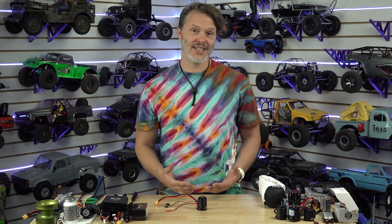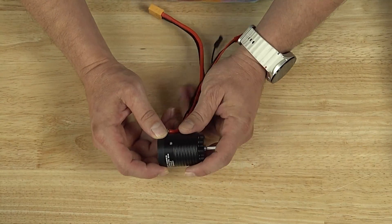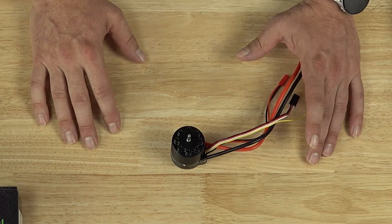For the 3000s, it's what I tested exclusively and I never had any heat problems. However, some of y'all have had heat problems. What we're doing is changing both our MOSFETs in there, reducing our MOSFET RDS on — the resistance of the MOSFETs — by 25%. It will be lowered by 25%. And I am going to increase the quality of the lamination, which is taking a little bit on the others, but on the 3000 it'll help. Everything is going to help as far as cooling is concerned.